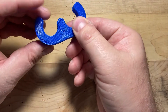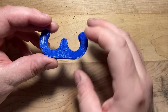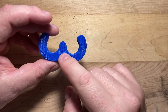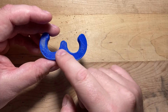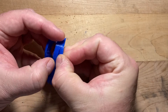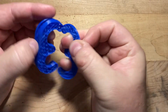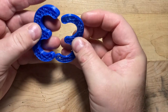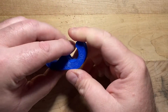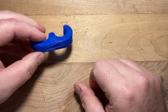I was printing things where the material wasn't extruding right. I'd have gaps in the face of the print, and then the layers would just delaminate very, very easily and completely come apart. The prints were very spongy and just generally not doing what you wanted them to do.